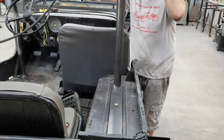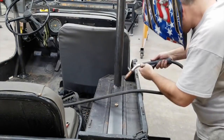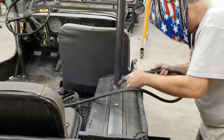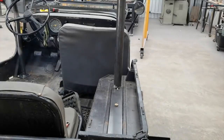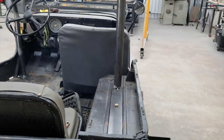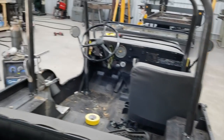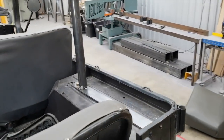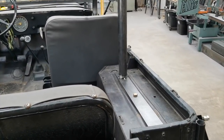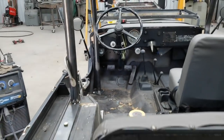Got four tacks on this side, then put the other hoop in and repeated the process. Off camera I pulled the entire assembly off, took it over to some steel sawhorses, and put it down lower so I could get to the inside easier and get my chair over there to TIG weld it all. I burned in some hot tacks with the welder all the way up — this welder is rated for 3/8 inch. I was having a little popping and stuttering on starts, so I got the ground closer to the work and ran a hotter welder.